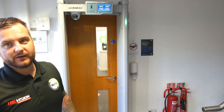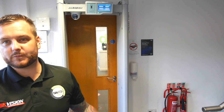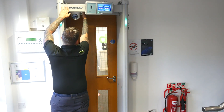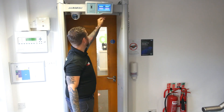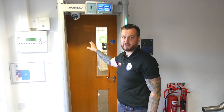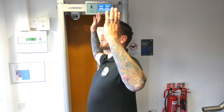Obviously the camera with the black body will screen people as they walk through. It creates that focal point for entry to a site and forces people through it rather than having a large open access area. When you take it out of the flat pack, it's simple: two panels, two cross members, and a metal plate. They bolt together and it takes about 30 minutes to fit. The cables connect to the RS485, you power it from mains, and you have it up and ready. Allow an additional 30 minutes to update the camera firmware, fit the black body, and calibrate it. Once set up, leave it 90 minutes to stabilize in the environment.